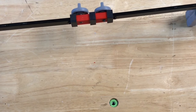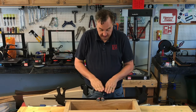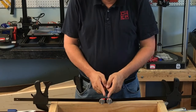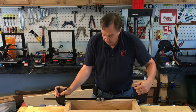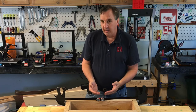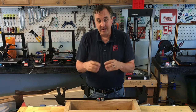Here's the finished new version — the two bolts are in place and the three little pieces are holding it. I can put this on the wood and really crank it down to see if it works. I've got the best of both worlds: the red one printed laying down has its layer lines parallel to the force, and the small black pieces printed flat then turned 90 degrees have their layer lines in line with the force trying to split the red one. When I crank this all the way down, I've tried numerous times and I can't get it to split. It's definitely more solid than before — very, very solid. The little black pieces also lift it off the wood slightly, reducing force on it.